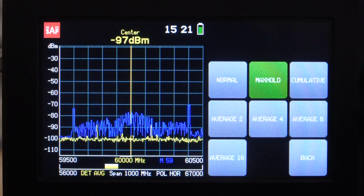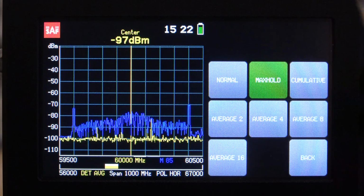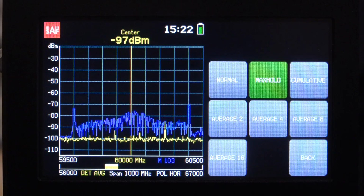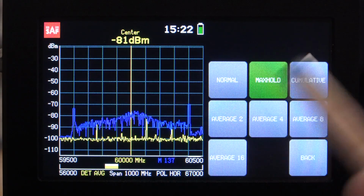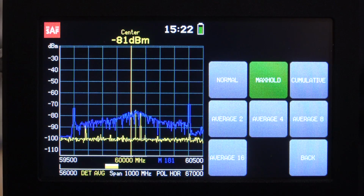But in this case, I get some additional information which would otherwise be invisible. So for example, in our sweep, this tells me that even though the sweep is very fast, the instrument spends most of its time at the beginning and the end of the sweep. This measurement is actually really hard to do because you don't have any way of knowing how long the instrument spends at a particular frequency. But because statistically it spends more time at the ends, you can see that the instrument catches that and tells you that there is a dwell time at the beginning and end of the sweep of my transmitter. That's actually something I didn't know about this until I used this instrument. So there is some valuable information you can extract from the behavior of the unit.